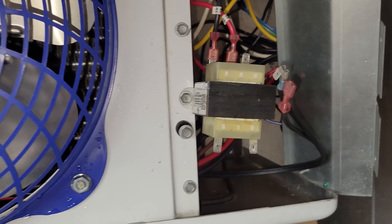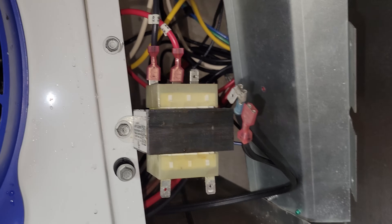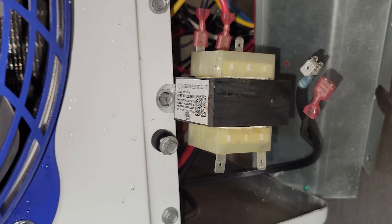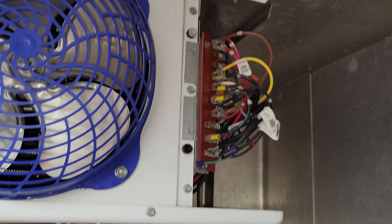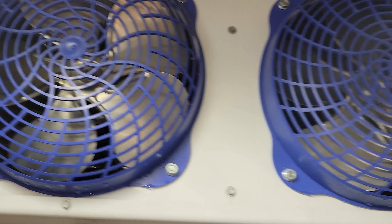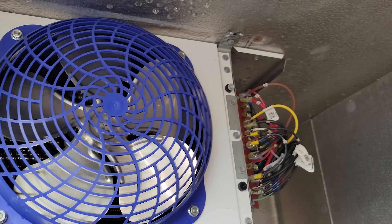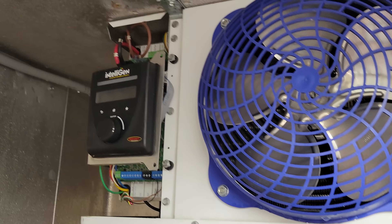Question is, why did it fail? I don't know. I don't have an OEM transformer, but there's not really much special about this transformer. So we're going to put in a standard one — I have a 75 VA with a resettable transformer. I'll put that on right now. I got it back together — it's temporary, not going to be a permanent fix. I also grabbed the 24-volt wires and checked them to ground to make sure there were no obvious shorts. Nothing shorted out, so we're going to turn on power and hope for the best.